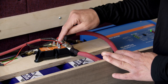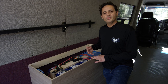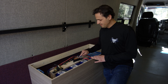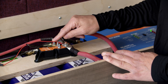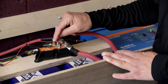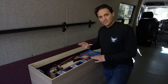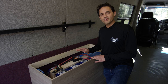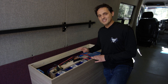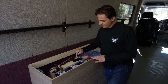There are a couple of other pins as well. One is labeled 'ignition' and the other is labeled 'signal.' It doesn't actually have anything to do with ignition — Precision Circuits uses the same template on a couple of their devices. In order to activate the device, the signal pin has to be grounded. You can see in this particular setup the signal pin is actually just jumpered to the ground pin. As soon as it's jumpered to the ground pin, the device is activated and it will shut off below your prescribed voltage. If it's floating, the device is not activated and it will not shut off. So it's important in the final installation that the signal pin be grounded.